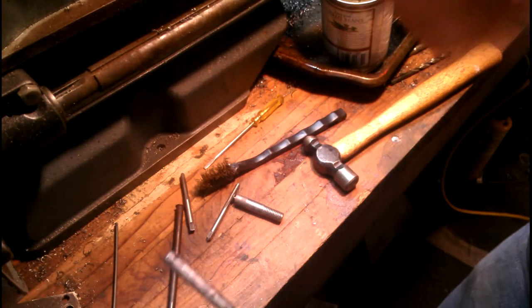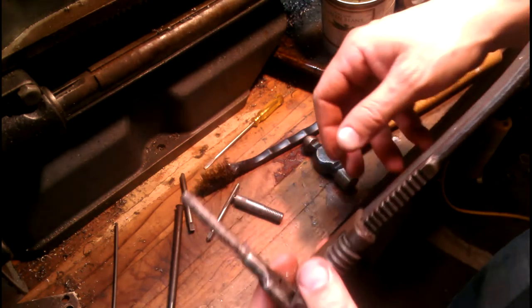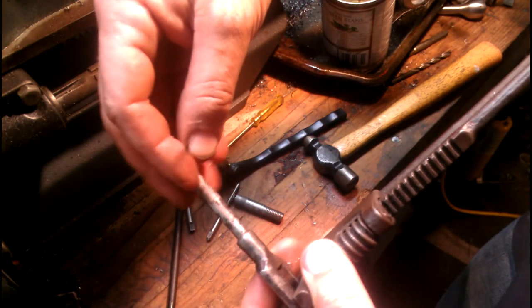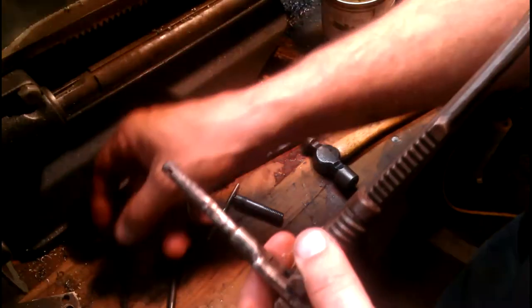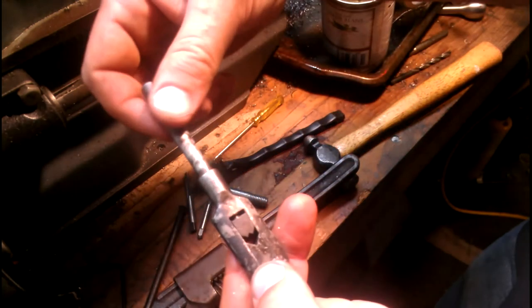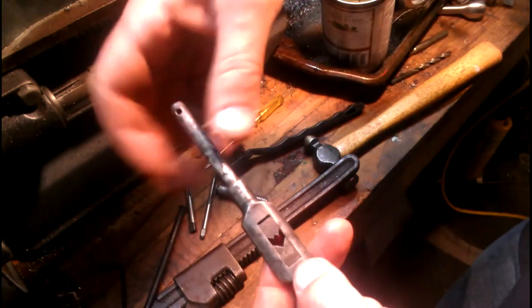And then I grab my old trusty Ford wrench here and I slip this — I just kind of held it there. These are smooth jaw — it's not like a pipe wrench where I'd tear it up. I put this through there and just started straining on it. Finally it moves. Once it moves, you're home free — just start wiggling it around. The threads are going to be really tight at first on this sort of stuff when it's all rusted up like that. Once you get it moving, just keep squirting oil in there, wiggling it around, running the threads back and forth. And even here in the slot, that block was having trouble moving. So when I got it open, I tried to get in there with the brush and just get anything that's potentially fouling the works out, and run it back and forth.